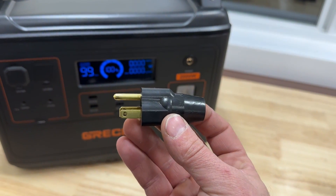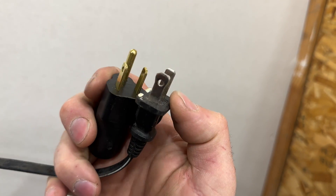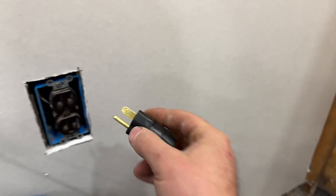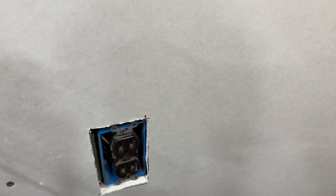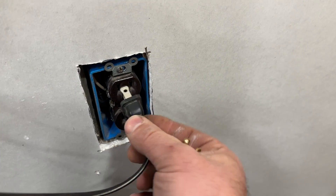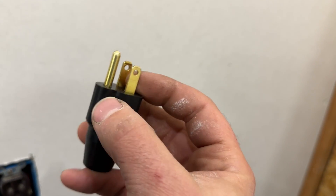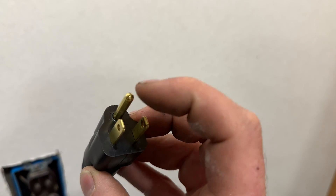This is the little gadget that's going to help you get power from your power station to your furnace. On a regular plug that only has two prongs, you've probably noticed that one of them is actually larger than the other. This larger one is the neutral because of the lack of a ground prong. When you plug this in, it automatically associates the right side with hot and the left with neutral — with two prongs, it simply won't go in the wrong way. All this plug does is take the ground prong and inside the connection it bonds the ground and the neutral together.